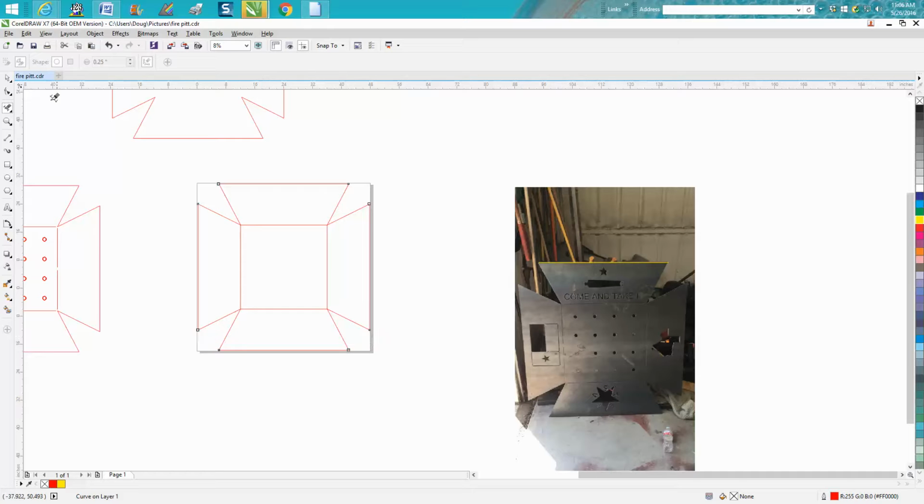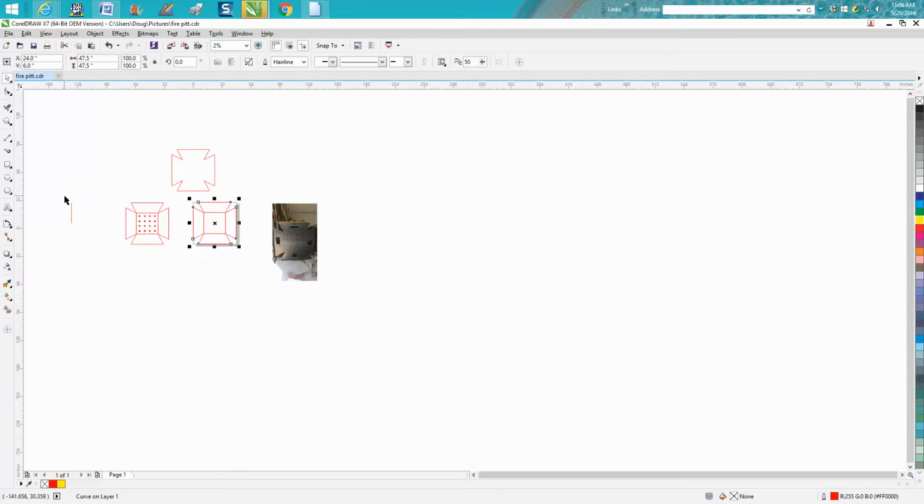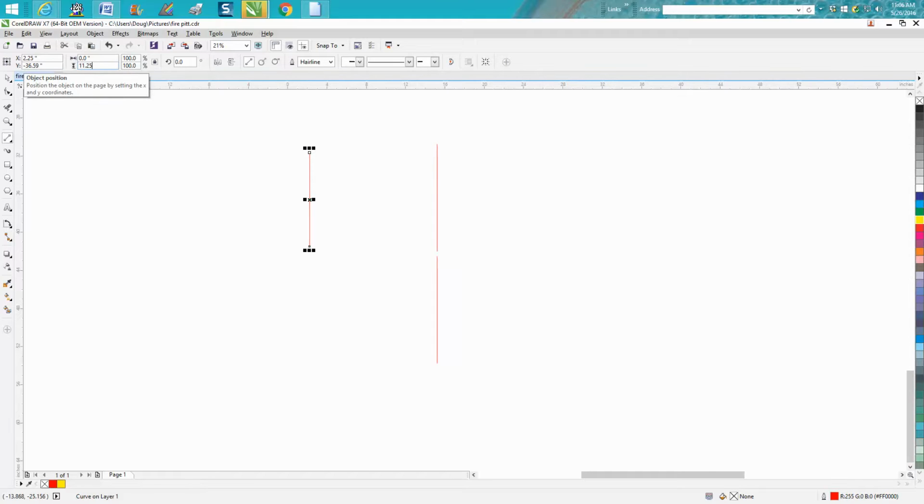All right, let's do this now. So we know that this is 24 by 24. I've already drawn a line, to save a little time on the video, but I'll draw another one real quick. It doesn't take much time. Hold down your control button, make sure it's a 2-point line. Hold down your control button and make this line 11.25.